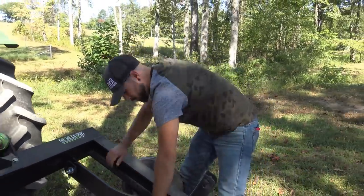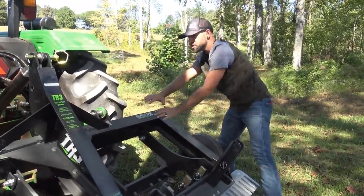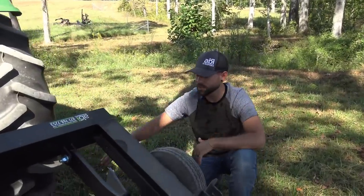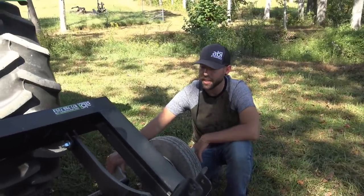You can actually grab material. As you grab more material, this blade floats up, and as you get to a low spot, the blade pushes the material into the low spot, giving this the function of grabbing your highs and moving to lows. This is what levels your surfaces for you. So this is the name of the game here, to keep this engaged.